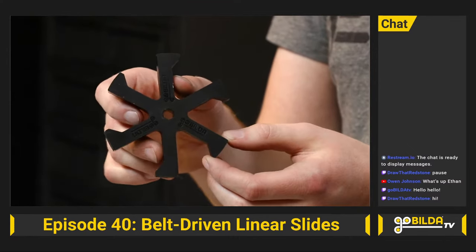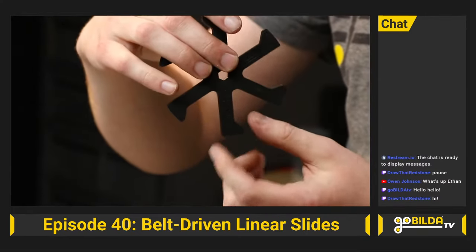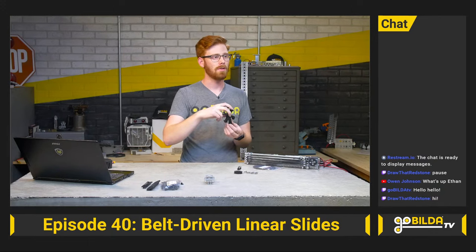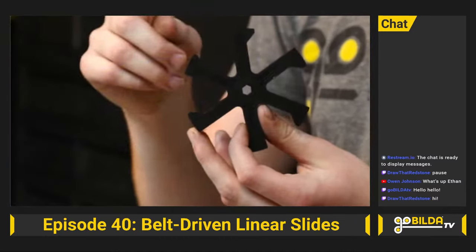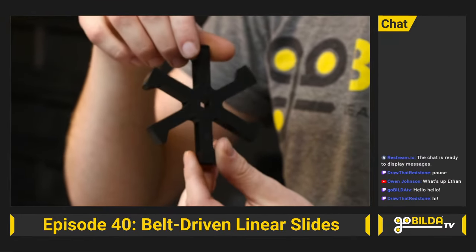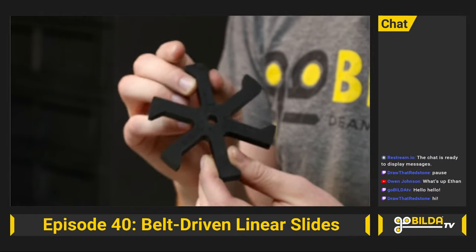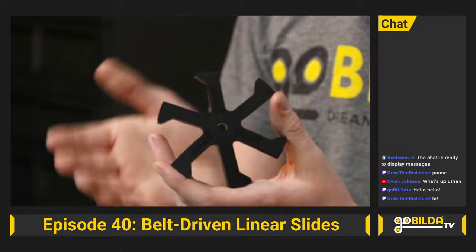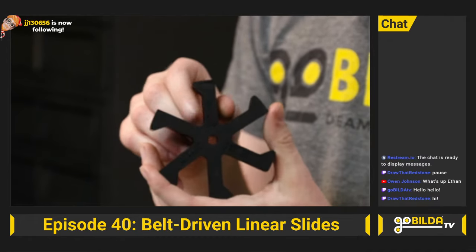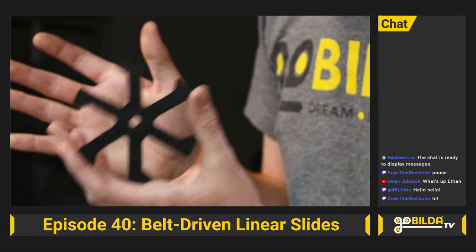The shape of the bootwheel is one of my favorites. In some situations you want to kick objects up into your robot — you put the toe of the boot forward to pull objects in. On the heel side, it pushes objects much more linearly. You have two options based on orientation, and it has a nice 8mm REX bore with a hard plastic core the soft rubber is bonded to, giving really good positive drive. We've had 48mm and 72mm versions; this 96mm is bigger and 12mm wide instead of 8mm — great for intaking larger elements.